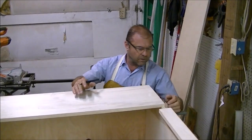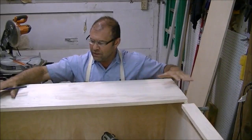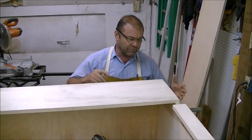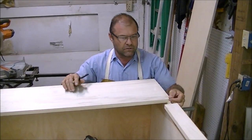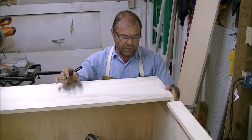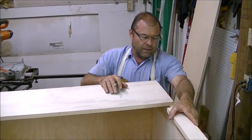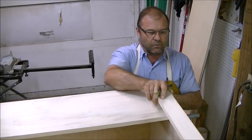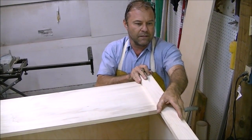Alright, next we want to take and put the top board on. Before we lay out the arch and all, I want to make sure I got the box just clamped together temporarily. We're fixing to take it apart and finish drilling the shelf holes. But before I do that, I wanted to go ahead and get this piece underway. And I just got it roughly lined up. I got it flush on the top. And we'll take our poplar wood here, and I've got it lined up.